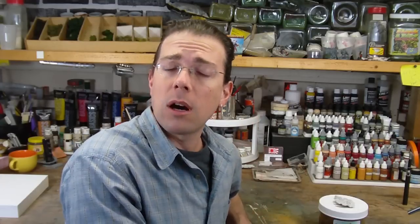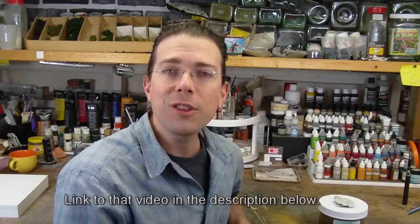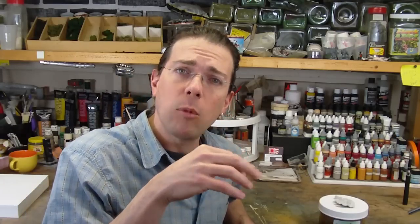They posted a video on bubble control, and what I decided to do was to go through that video and follow each of their steps very carefully. One of the things they mentioned was that I might be overheating the power mold, which is quite likely, actually. In my mind, I wanted as thin a product as possible, but I may be overheating it, causing some boiling within the compound, which would, of course, introduce bubbles into it.